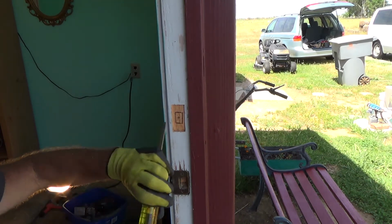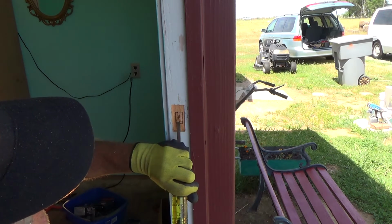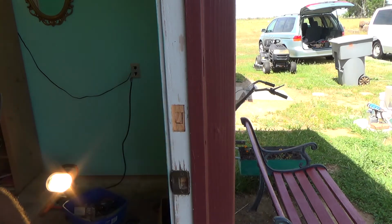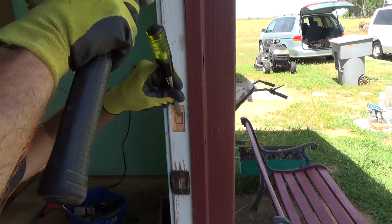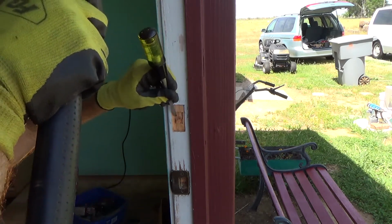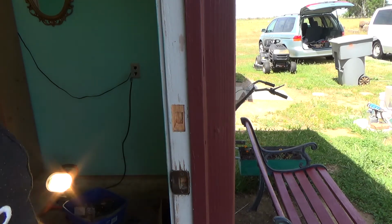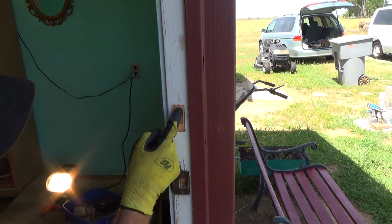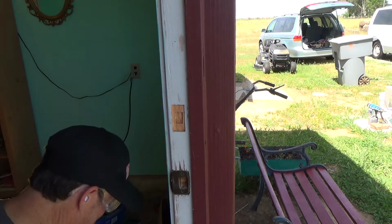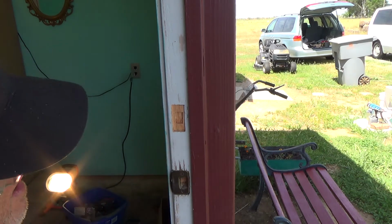Okay. Go from the bottom up. Tap, tap, tap. Like that. And then go from the top two-thirds on down. This is if you didn't have a drill bit. But see, obviously your drill bit is not rectangular, is it? That's why you got to get it a little bit bigger, and then it overlaps on the inside of your strike, and you don't really see that anyways. Capiche?